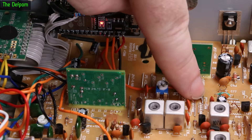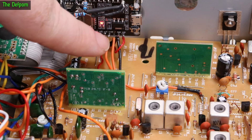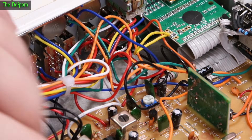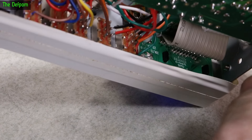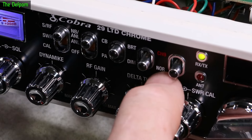Here's the wiring: there's a diode onto jumper JP23, going to D13. D12 runs to the channel 9 switch. When the switch is in the channel 9 position, that's the FCC 27 MHz band. When it's in the normal position, that's 26 MHz New Zealand band. It's all working.